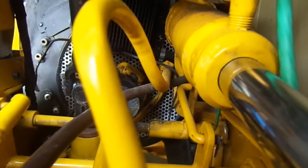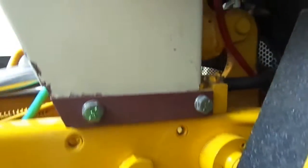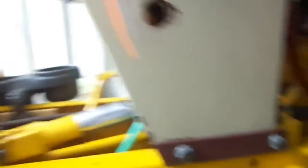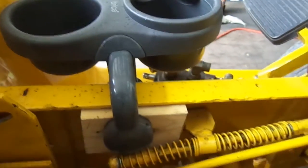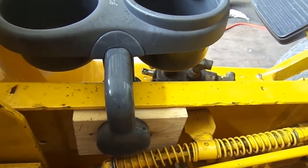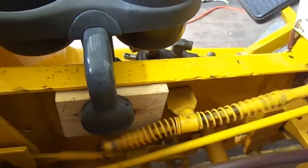I just noticed that line moving up there — I'm hitting that line. I'm glad I seen that. I'm going to wear a hole in it. Anyway, that's the shaft that went through there. All I done was just moved all this stuff down. I moved this down, then I moved this pivot point that used to be up here — I just moved it up here. See, it's doing the same thing it was doing up there. And your neutral spring — see that spring on the end? When I let go of the pedal, it's pulling right back to neutral. When I go in reverse, it's pulling right back to neutral. No matter what I do, it pushes right back to neutral.